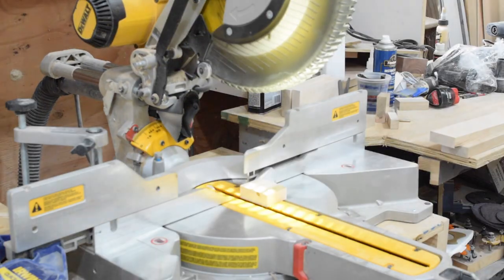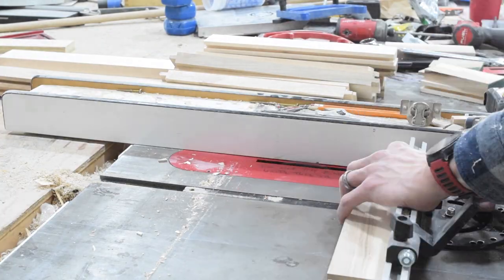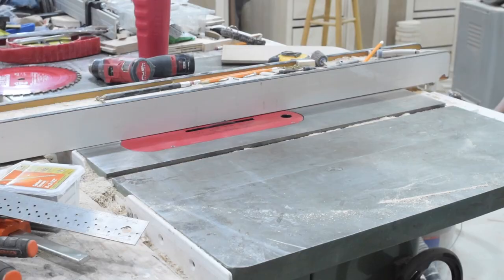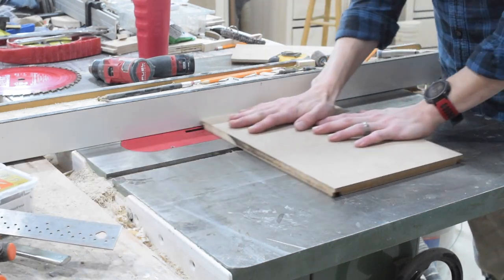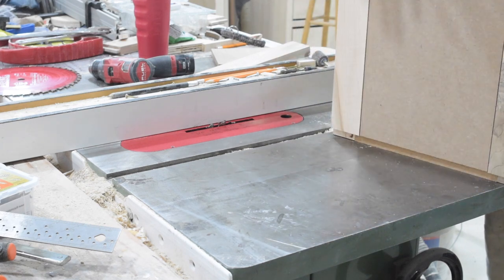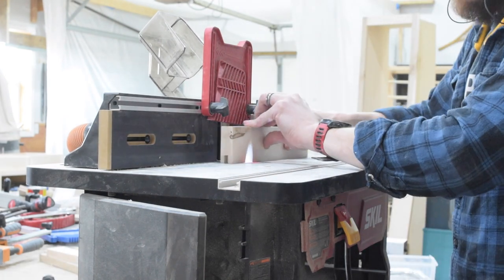After trying to fiddle around with router tables and router bits for making my doors, I finally settled on just making my shaker panel doors on the table saw — using a dado stack and cutting out my rails and stiles that way. I found I was able to get really good accuracy very consistently. For my shaker panels, I actually found that I enjoyed back-cutting half-inch material so you get the flat panel look but also a thicker, more robust door with increased weight that just feels like a more quality project than your standard quarter-inch or five-millimeter center panel.